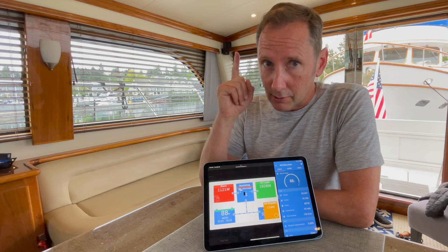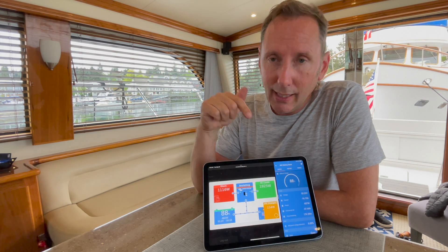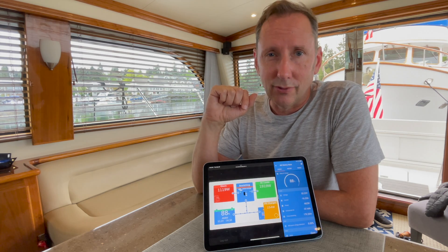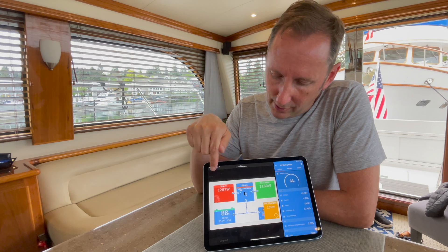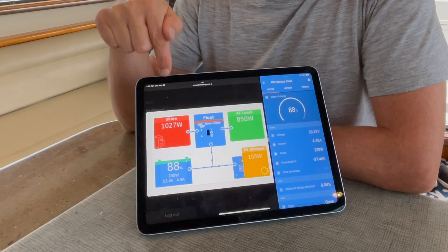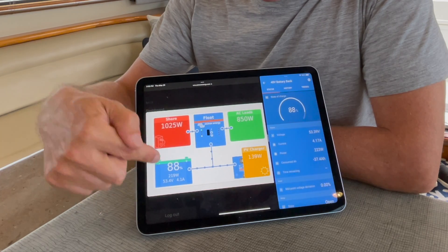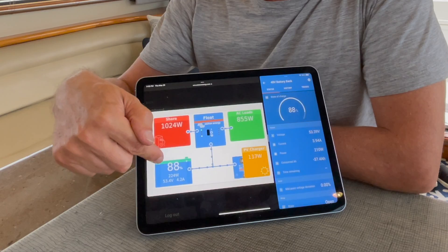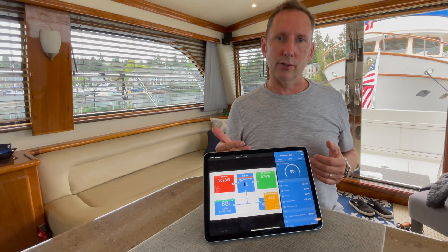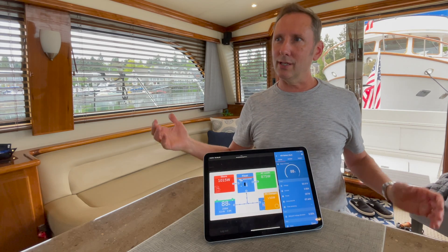A person looking at this critically will ask: you're assisting with your batteries — when that load goes down, what happens to your batteries? Let's go turn off the air conditioning. Now that it's off, shore power is sitting down at 1,000 watts and our AC loads are sitting at 850 watts. Where's the extra wattage going? The extra wattage is going from our inverter-charger over to our battery bank — our batteries are just recharging themselves. That's the ebb and flow of power assist. It pulls off the batteries when loads are too high, and once loads diminish it charges the bank back up so it can keep doing that ebb and flow. You never have to worry about managing your loads.